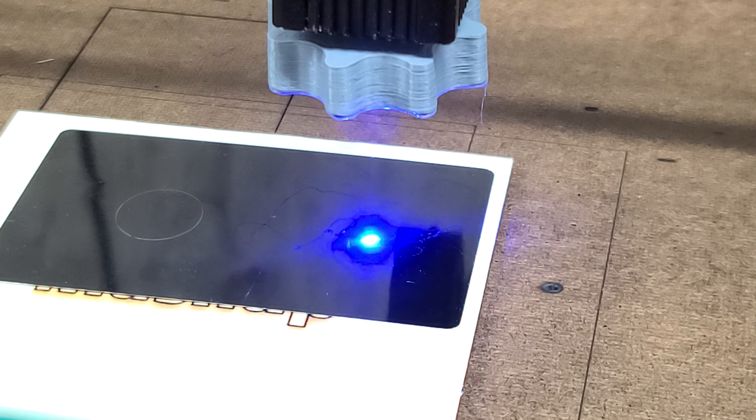I've got my laser on at about 10% power — a little bit stronger, but it allows me to really get a good view of where my focal point is. It's impossible for me to see this except through the camera because the safety glasses I'm using completely block that nanometer of light. I can't see anything on the black business card unless I'm looking at the video camera display. As you can see on the display, the bright blue light being emitted is a lot of light bleed.